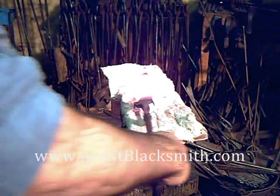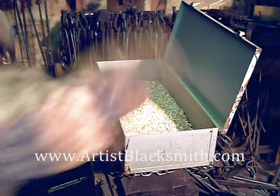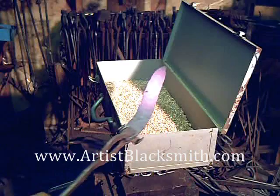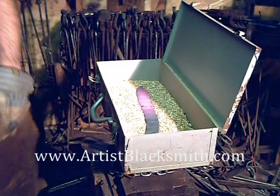You can do a little bit of grinding once you've finished heat treating. Right now I'm doing thermal cycling — this is on top of a piece of kaowool. I start at essentially a bright orange, then let it cool to a black heat. I do this several cycles, three times — starting at bright orange, then medium orange, then bright red. Then I bury it in vermiculite. It's just a box, and the vermiculite is simply an insulator that doesn't burn. I place the knife in and pour vermiculite on top.